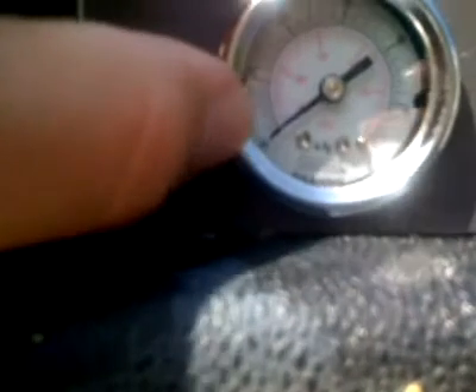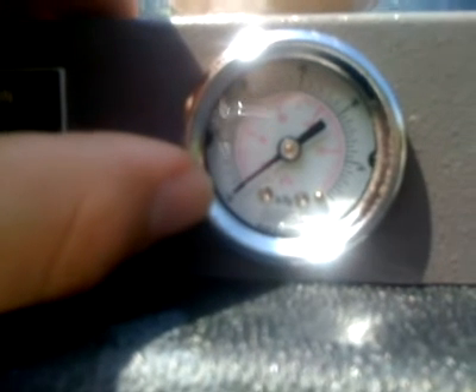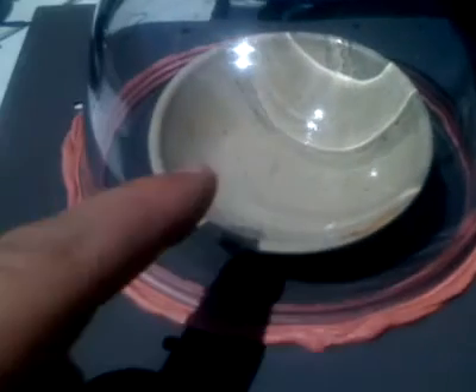A few minutes later and I've improvised with a child's buggy umbrella — I've improvised some shade for the compressors. They're still pretty darn hot, but you can definitely keep your hand on them. Not visibly any outblowing here, a little bit of condensation — that's the output of the second stage. But back at the bell jar, it's dropped even more. The needle is a gnat's whisker away from minus 30 inches. And I notice in the bell jar that all of the condensation that had filled it before has gone — not a drop left, just the water in the tray.